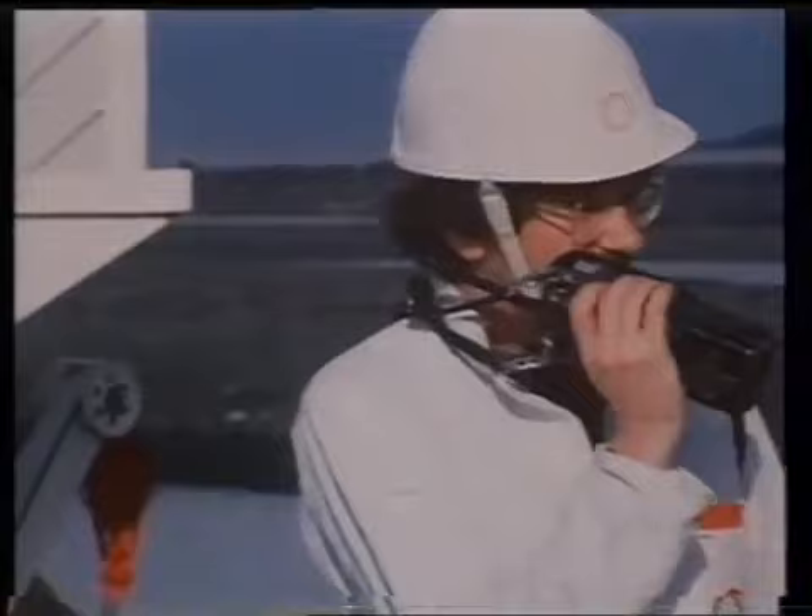Finally, check their labels to ensure that all portable apparatus such as portable radios, torches, or insulation resistance testers are specially approved intrinsically safe types certified for use in hazardous areas. If you use portable electrical equipment or tools, ensure that their connections and cables are sound and safe to use in the area in which you intend to use them.